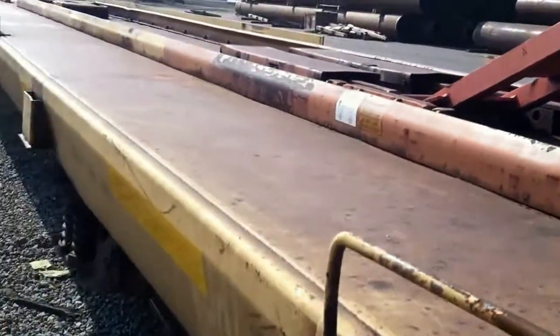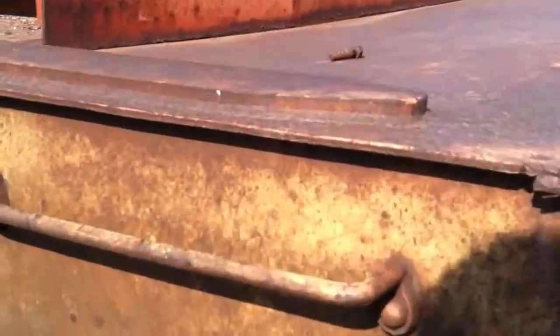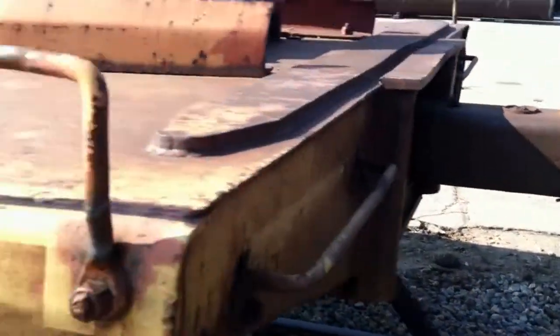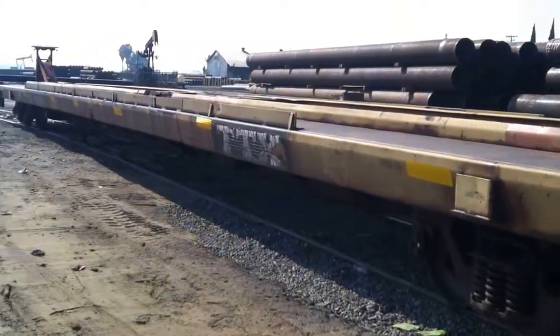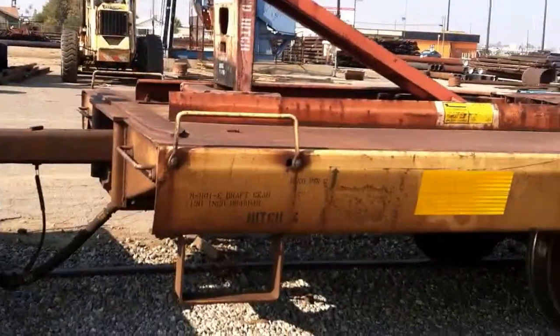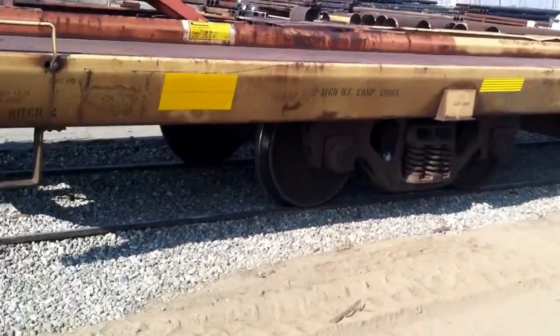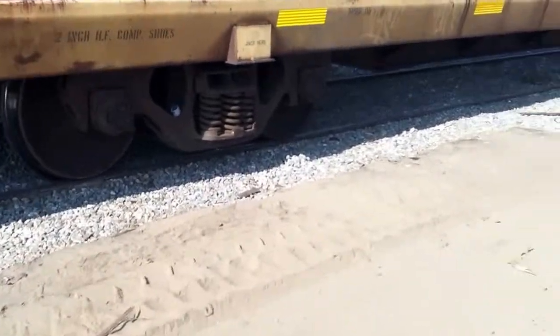This is the B unit. Let's take a look again at the A unit — they're identical rail cars. Let me explain the hand brakes on this car. Since the mechanical brake is only on that side over there, this thing has air brakes and mechanical brakes. The mechanical brake, that lever you crank over there, will set the brakes on these two truck sets here, but not on this side. This side does not have any mechanical brake levers — it has all the same brake levers but not for mechanical use. The airline goes through here and will set the air brakes but not the mechanical brakes.